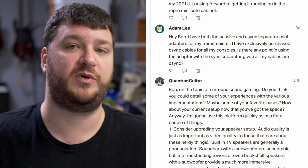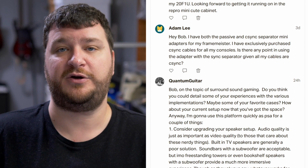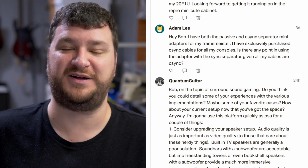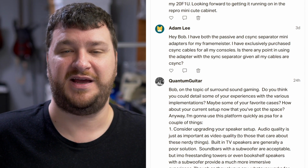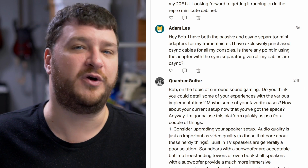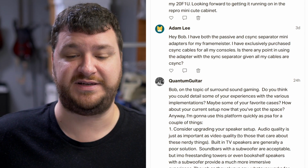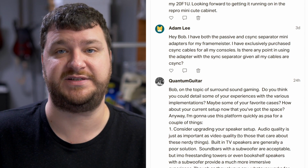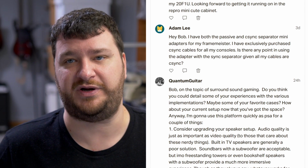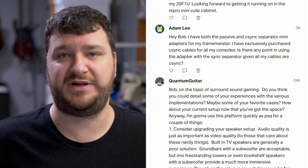And also remember that whenever you're talking about analog video, every single thing that you put in the chain could potentially have a negative effect. Now, depending on the cable and depending on everything else, the negative effect might simply be an imperceptible shift in the video or something that you'll never notice or never cause harm, but it's still there. So not only would I say don't use it, if you needed two adapters for whatever reason, I would remove the sync stripper from the other one. If you only need one adapter and everything's all plugged in, I would throw it in a drawer, just in case you run into a problem at some point, but you shouldn't ever need that.